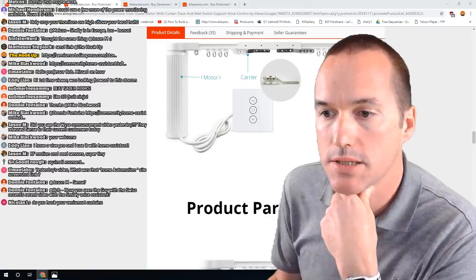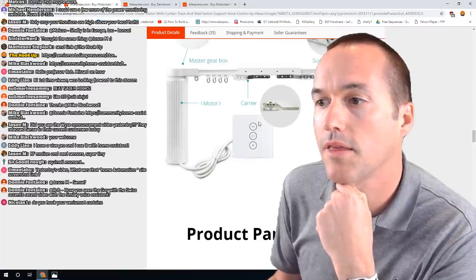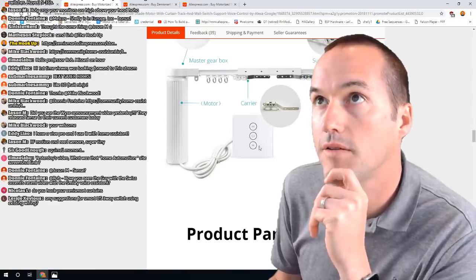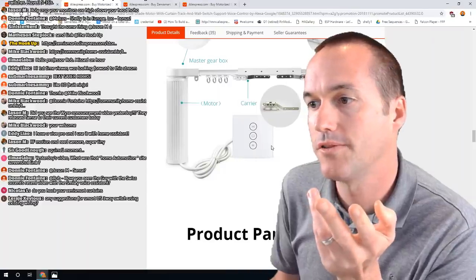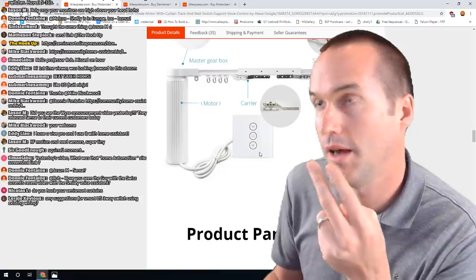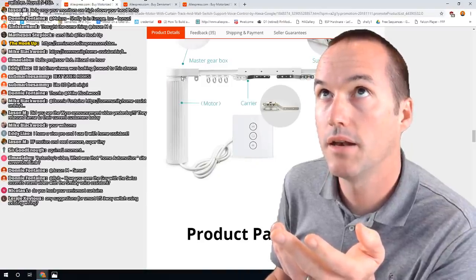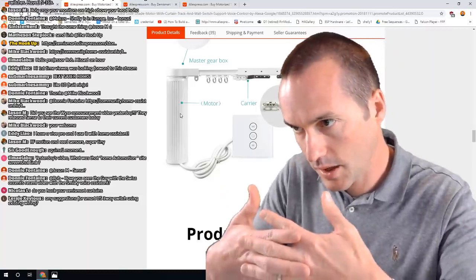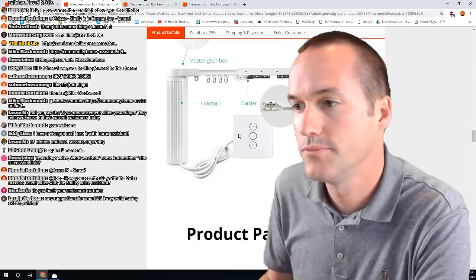Did I hack my Zemi Smart curtains? Yes. Okay, so you can still see what I'm seeing. This thing here is Tuya, and so that means that this works directly with Tuya Convert. And I just set up some Tasmota rules so that it functions the way that I want it to, so that it doesn't turn the open and close relay on at the same time. But all the smart stuff, really, this is just a switch. It's just a two relay switch, right? So when you press the top button, the first relay opens, and when you press the bottom button, the second relay opens, and it closes the first one. So in Tasmota, you just set them up as latching relays, so that when one opens, the other one closes. And then all the smart stuff is in the motor. So the thing that figures out how far they've moved and if they're closed or open, or all the way closed or all the way open, that's all in the motor. So this is just a generic switch that has 2 relays in it.